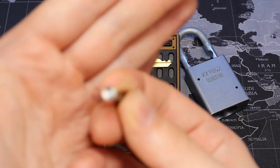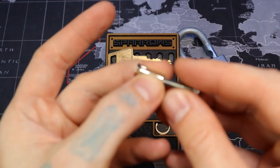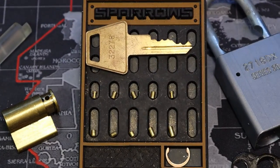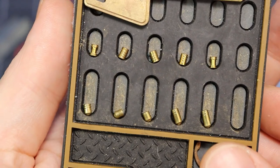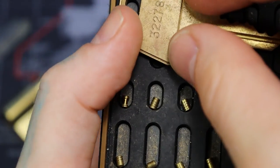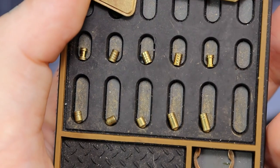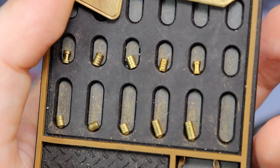I had to actually drill it out like I did the Series 10, and replace that with the normal pieces we're used to seeing in there. Anyways, we do have this gutted and in typical American Lock fashion we see serrated bottom key pins — it's only the two lowest that have no serrations. And then we see our top driver pins: we have serrated spools and then just serrated drivers.